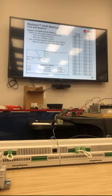We have to open that file. That's 6 months for us to change. But at least you do know that for right now, don't go above 46 on that one. And again, you should only see that on 15 horsepower motors. It'll be a dual fan, or a single fan 15 horse, or dual fan 15 horse. You'll see that motor. That's the most common. And even then, it's rare, but we want to give you the information.